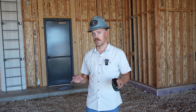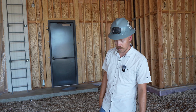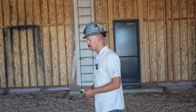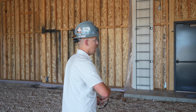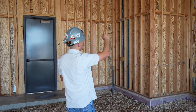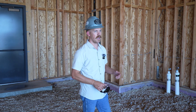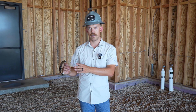As far as the vanilla shell goes, that's all we have to do — get these conduits underground ready for whoever's going to occupy this space. There's no slab yet, we're just on gravel, so they still have the opportunity to dig up and take that conduit wherever they need. As far as wiring for this building goes there's not a lot going on. We have lights on the exterior — some wall wash lights, some wall packs and things like that. We come out of that house panel and we ran MC cable up the walls distributed to all the different lights and receptacles. To rough this in it only took us a couple days.